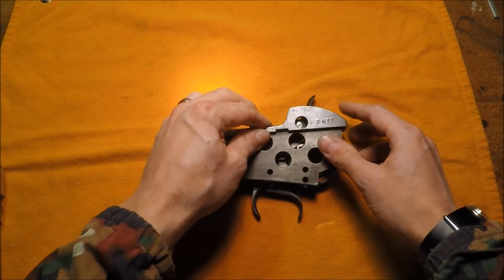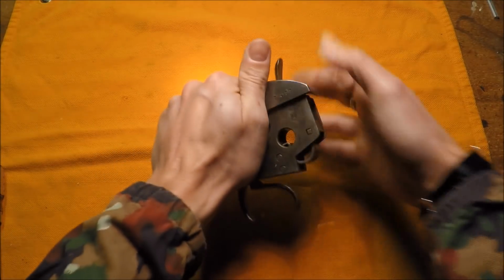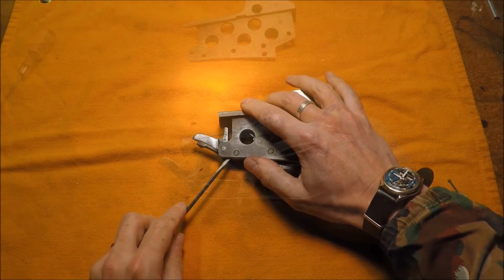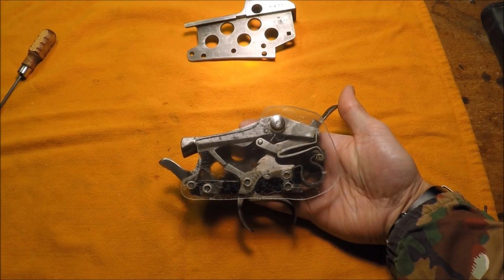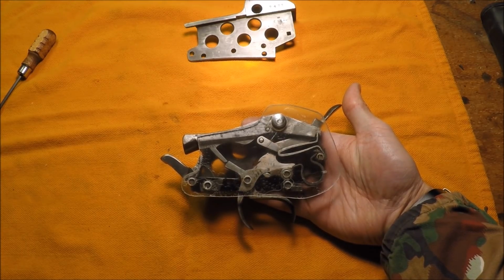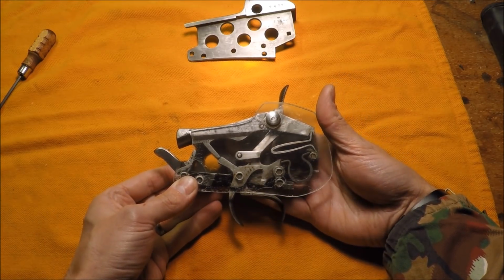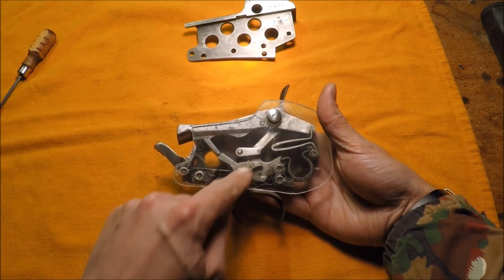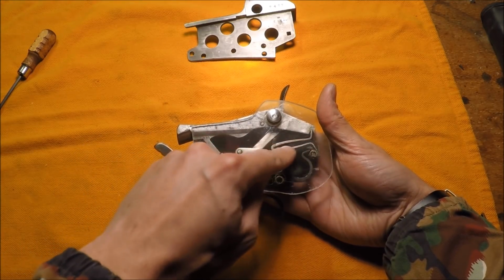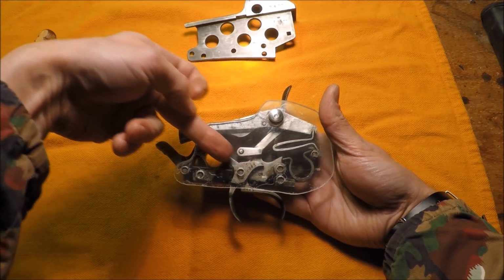So I'll just put this back on. Cock it and very carefully prise it off. Okay, so with it cocked, I've taken the cover off and replaced it with the Perspex one, so now you can hopefully see the whole thing working. So now we fire. There we go. As you can see, trigger moved forward and this stayed put. It's effectively being sandwiched in place due to this spring here, which is tilting, forcing it down against the blocking arm.